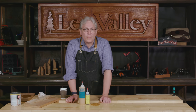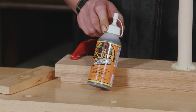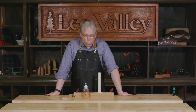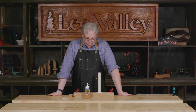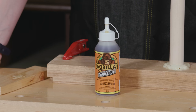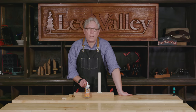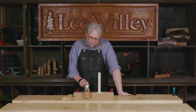There you have it — animal glues are a tremendously versatile addition to your arsenal, not least because of their ability to take finish. The polyurethane glues are a relatively recent addition, within the last 30 years or so. They're related to other polyurethanes like varnishes — where varnish cures to form a finish film, polyurethane adhesive cures to form a glue line. Polyurethanes work really well for gluing dissimilar materials like wood to metal, are very good for lamination work because the glue line is very rigid, and also excel with exotic woods that have a high oil content, which are notoriously difficult to glue successfully.